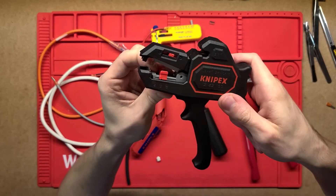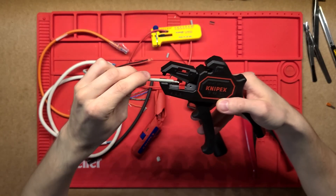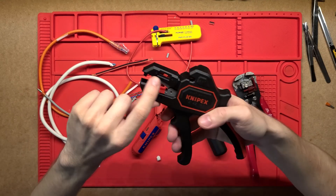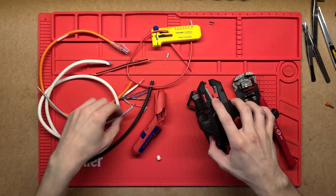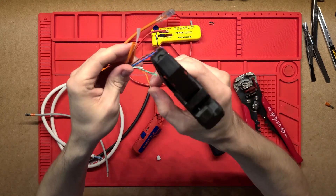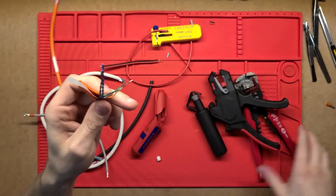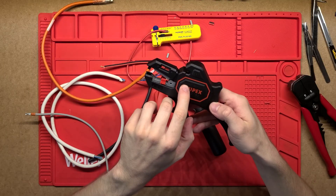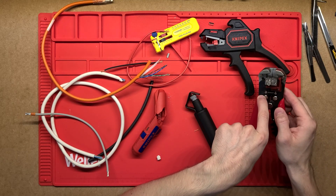Same with this one — you've got this red arm here that you can slide backwards and forwards between 6 and 18 millimeters, so you can have a consistent length of strip each time. This little slider up the top here just adjusts the down pressure on that cutting tooth. If you're working with thicker cable, usually put it on the least resistance on the negative; if you're working with really small fine stuff, put it on the plus for a bit more push down. For example, this here is just ethernet cable twisted pair — you get that in, strip it, it pulls nicely, and that's nicely stripped. This will also strip some of these finer cables really well — it's rated from 0.2 to 6 millimeters, same as the previous one.